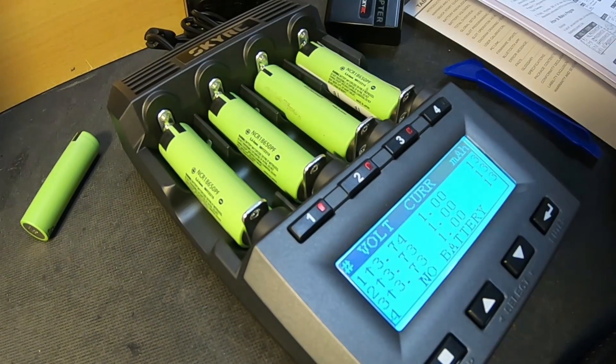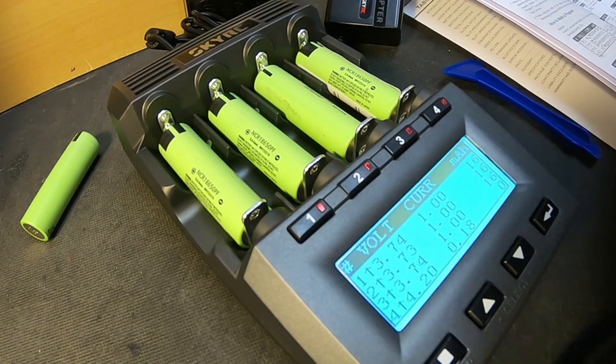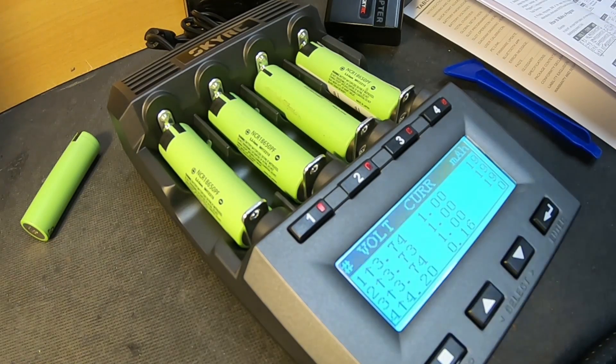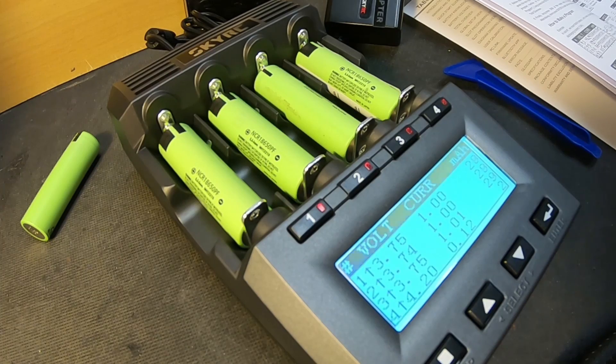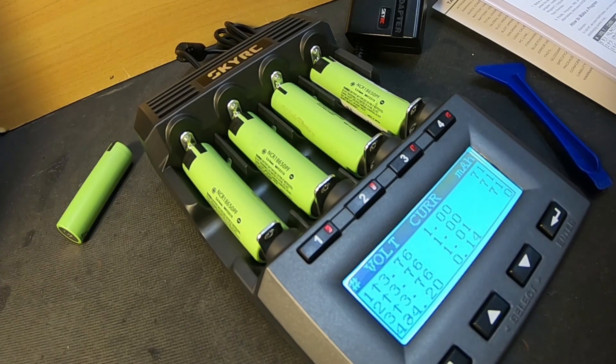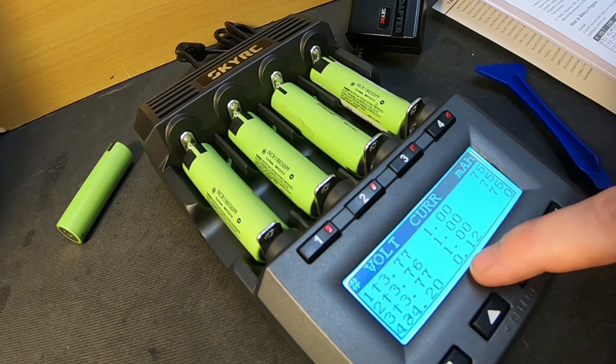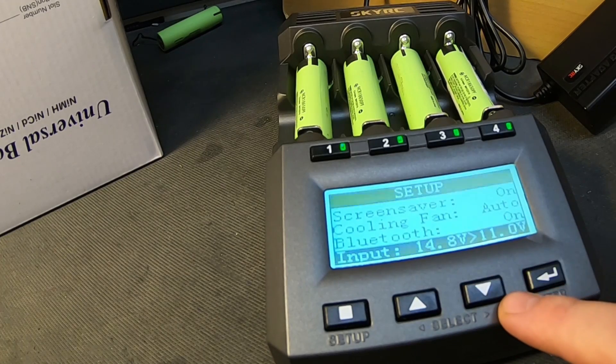It's quite tricky to get them in there. No battery — program zero — yes — processing. I'm gonna leave it like that and go refresh my coffee. Now 0.12 amps. We want to do a cycle — first charge it up, discharge it, then charge it up again. Start that one on cycle charge. It has a different symbol — those just have an up arrow for charge and this one has a loop symbol. And yes, I think it is charging — it will show a minus sign if it were discharging.